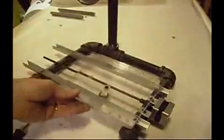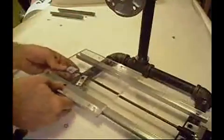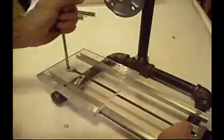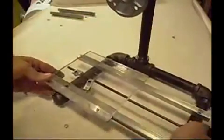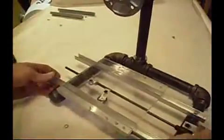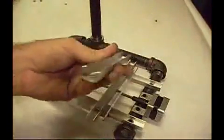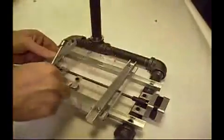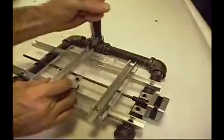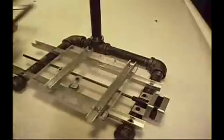You see when you tighten the screw it just tightens right up to that rail. And then this is the coupling nut — tie that to the X stage. Then you see when the motor turns, that makes the stage slide back and forth.